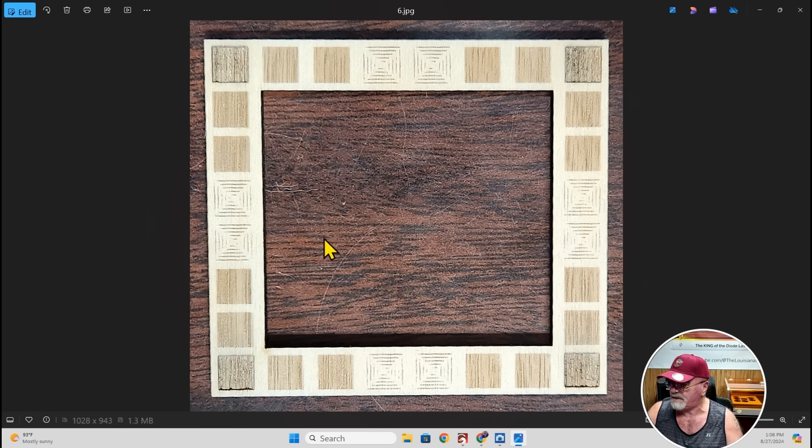This is a representation of a picture frame. In the corners you can do a dark fill, then lighten up the next two sections, and then offset fill at a very low LPI — I think I did the center ones at 6 LPI — and you get all types of different looks for a really nice picture frame. If you take a square, copy it along the path, put sections on different layers, then cut it out where the square is just a little proud of the wood, you'll get an incredible-looking design. I used one, two, three different layers with three different fills, three different speeds and powers, all in the same job.